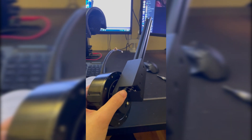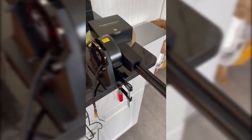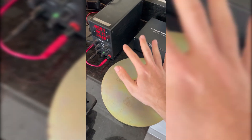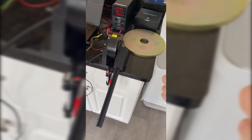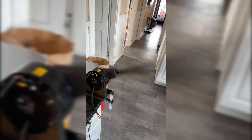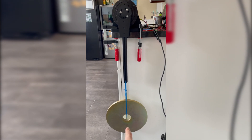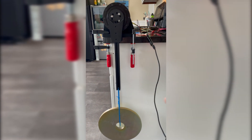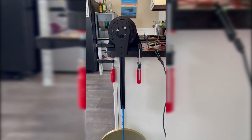Time to really test this torque a little bit. I got the actuator set up — about 4.5 kilograms. That should be about 15 Newton meters, so this thing should easily lift this. 4.5 kilogram mass, 350 millimeter distance. Only running this at 31 volts, because that's what my power supply goes up to.